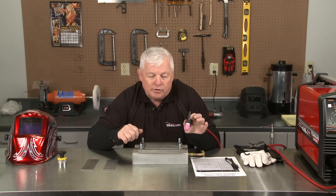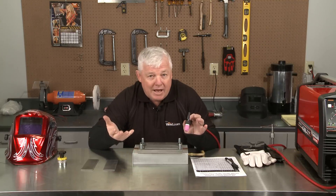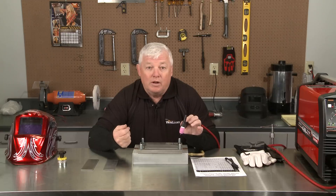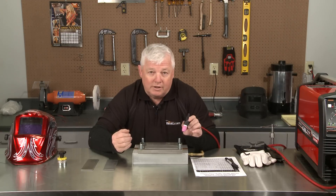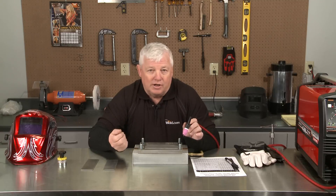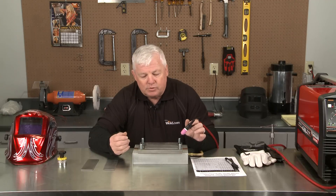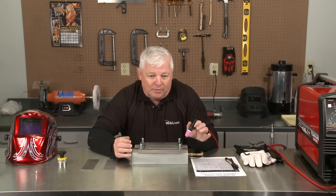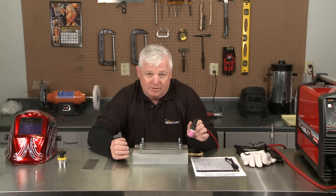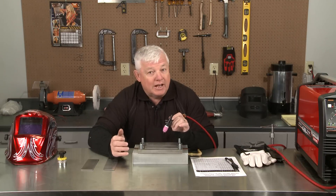When I finish the weld, I'm going to turn the part over and you're going to see the penetration. If you put a purging or a gas backup to this penetration, you're going to have an excellent looking weld on the backside. If you didn't — if you took shortcuts and didn't put gas backup — you're going to find that it welds a little more difficult and you're going to find oxides on the backside. These oxides will definitely shorten the life of your weld, whether you're welding exhaust parts for a race car or high performance car. Stainless steel has its place — it's a great material and it's actually easy to weld. So we're going to get started. I'm going to run half of this plate without gas backup, and the second half I'm going to turn the gas backup on.